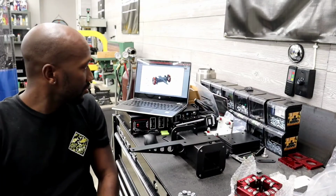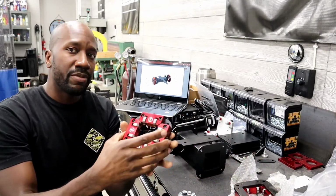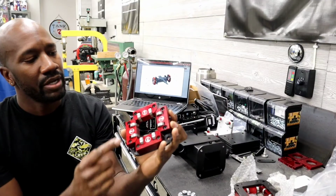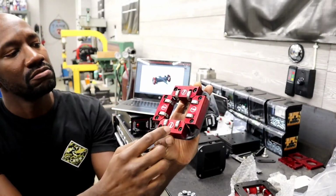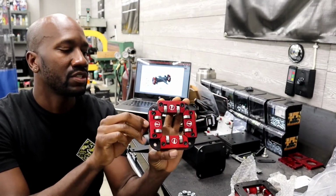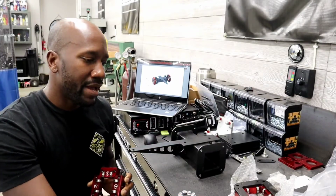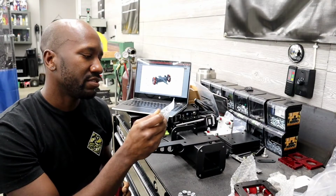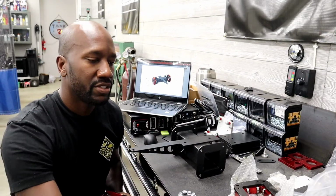All right, this is the next step. We're gonna install the bearing block flange assembly, which are these bad boys right here. They've got four different bearing areas, but anyway, right here, this bearing is slotted, and this bearing joint right here is slotted as well. You want to leave those loose, and make sure that the others, the ones that aren't slotted, are tightened. Get bag 16 with the flange nuts, bag 7 with the head cap screws, and also bag 19 with the stainless steel washers.